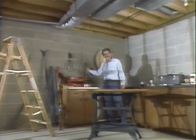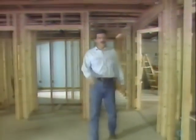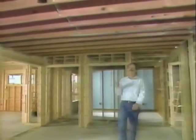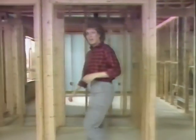After the rough-in inspection, we'll install surface raceway on this 20 amp circuit and another on this 20 amp circuit. The 6th circuit, also 15 amp, supplies the new wall receptacles we've installed around the perimeter. Again, the overhead light is run by the existing 15 amp circuit. The 7th and last 15 amp circuit supplies the power here in the new addition.